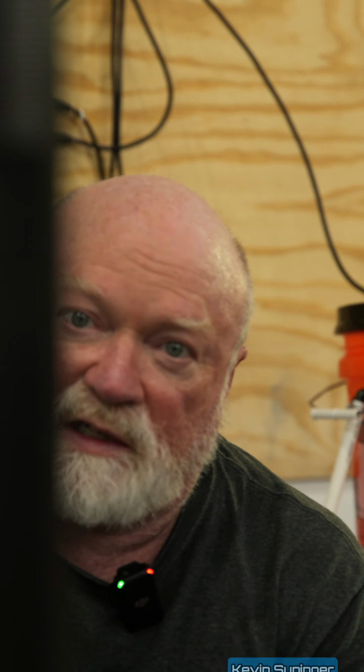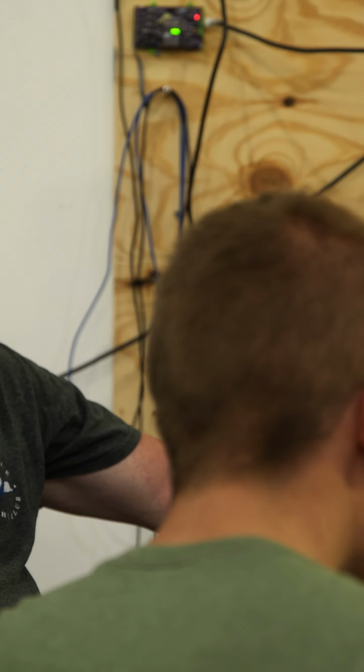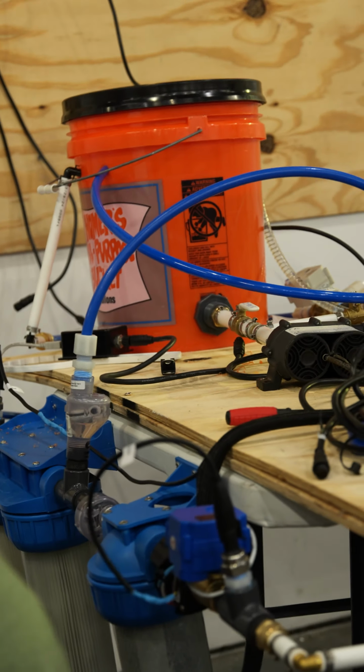And then you have your NMEA2000 stuff and your diags, okay. And the diags allow you to turn on and off various outputs manually to test your connections. You'll see your pressures and flows, and you can run flush cycles and booster pump cycles. So right now, let's go ahead and turn on the booster pump. Okay, so that just turned on. You see the water pressure coming up to 30 here.